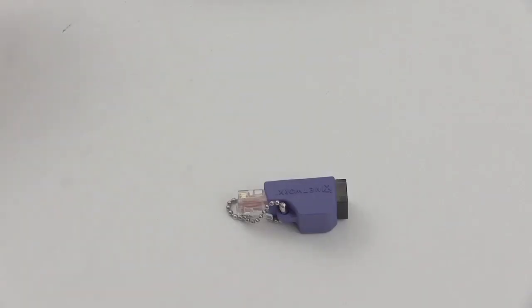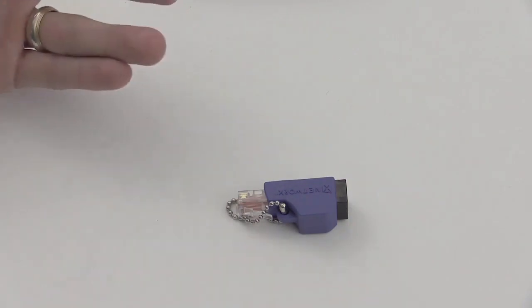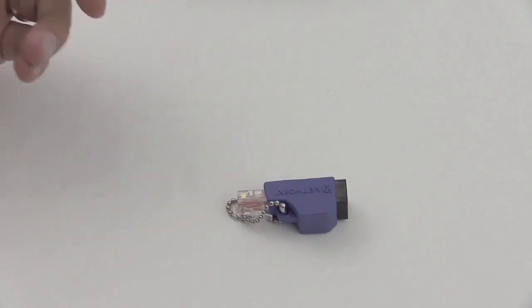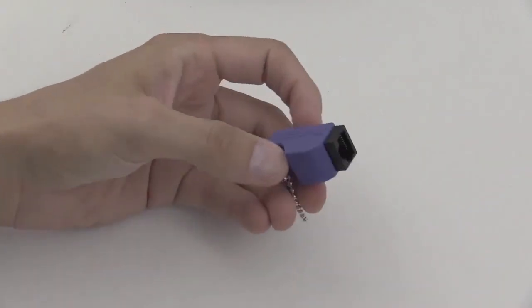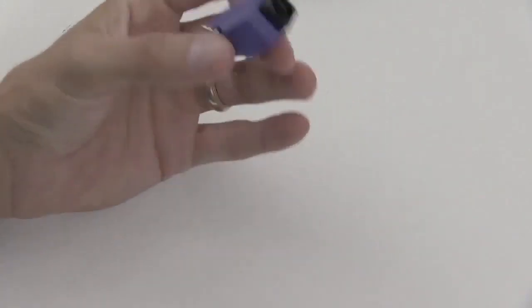Let's talk about loopback plugs. There are loopback testing devices for just about any type of communications connection. It could be a serial connection, an older DE9 connection. You may hear these referred to as loopbacks or bouncebacks or null connections, whatever you want to call them. I usually just refer to it as a loopback. And the most common one is the Ethernet RJ45 loopback connector.